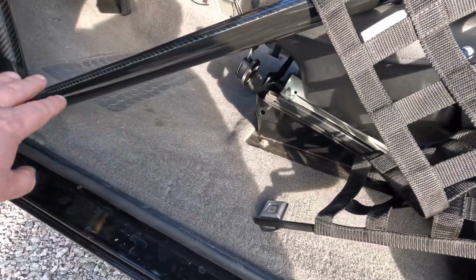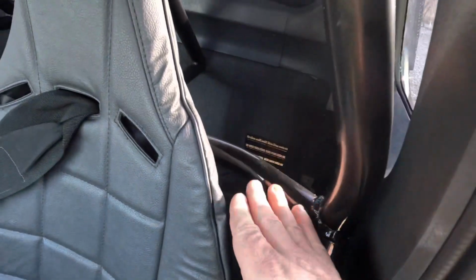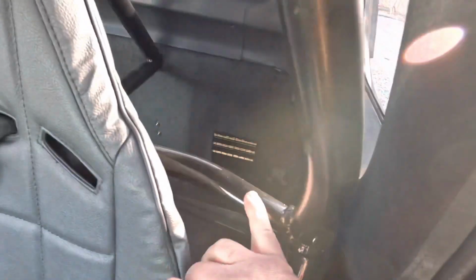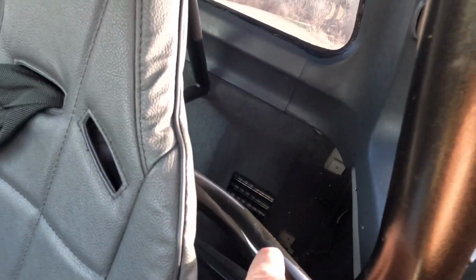And then, like I said, you have to have a rocker bar here. If you don't have the rocker bar here, you can do it under the rocker there. It doesn't really matter as long as that attaches to the frame. The bar behind the seat here can be a smaller diameter. This one is actually 1 1/4", so he checks that to make sure that that is 1 1/4".